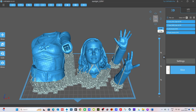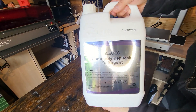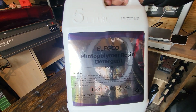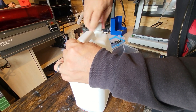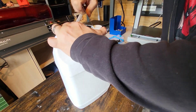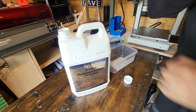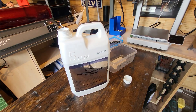It's going to be printing at 1.7-second exposure times, and I'm going to be cleaning it with this Elegoo Photopolymer Resin Detergent. There are some benefits to using this over IPA. Firstly, and a big one for a lot of people, it's non-flammable. It works by dissolving and removing uncured resin, which saves a little bit of time. Elegoo says there is no skin irritation — this detergent has a pH value of 6.2, so there's no irritation or adverse reactions on the skin. It's non-toxic and ensures safe use. That said, I would suggest wearing gloves, because some people are sensitive to some things.